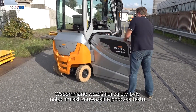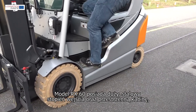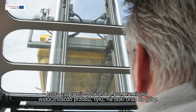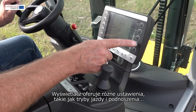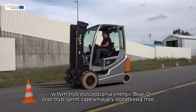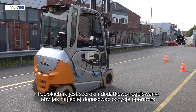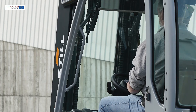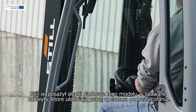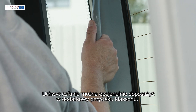The advantages mentioned are immediately noticeable during the test. The step on the RX60 is spacious and there's plenty of workspace in the cabin. The view through the mast, over the dashboard and through the roof is very good. The display offers different settings such as driving and lifting modes, including BlueQ energy saving and the sprint mode for extra power. The armrest is adjustable but could be lowered a bit deeper. Still has equipped the roof posts with a welded steel handle, though these feel a bit cold. On the handle for reversing, the optional push button for the horn is missing.